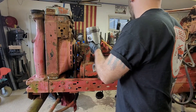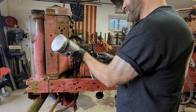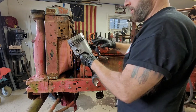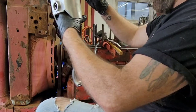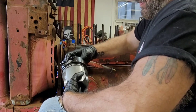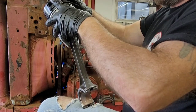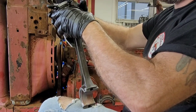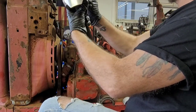And now what I want to do is, before I start dropping it down and getting it ready, get the spring compressor, piston ring compressor, opened up. Now, let me see if I can do this while I'm trying to hold it for the video. Not the easiest thing to do. Now, you want to make sure that when you put this on, don't mess up your gap, which seems like this one actually works a little nicer to go on without screwing your gap up. Okay.